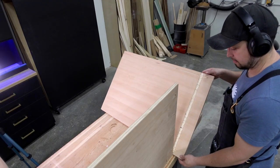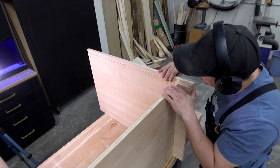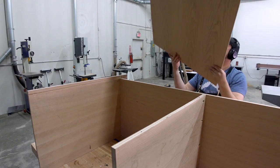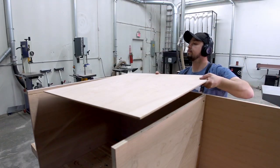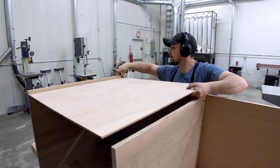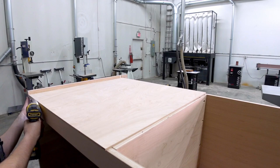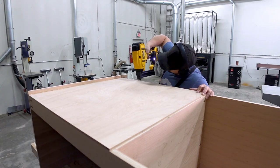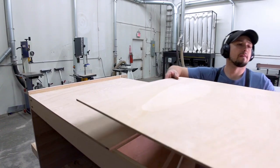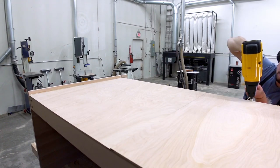This is the base cabinet, and building it face down on a flat table gives me the chance to assemble the backside, knowing that the front is all flush. The back in this case is 2 pieces because it saves me from buying another sheet of 1/4-inch ply. I also don't glue my backs on because there have been a few times where I've needed to pull the back to re-square the cabinet, so screws or staples are a lot easier to pull.